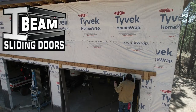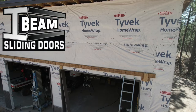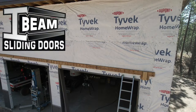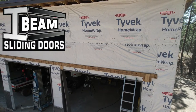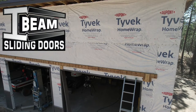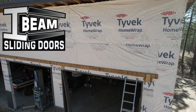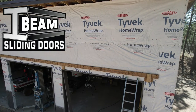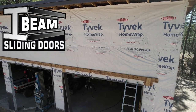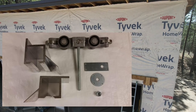What I've done is put up an inch-and-three-quarter LVL that you see right here. I pre-drilled it and recessed the holes for hex lags — these are five-and-a-half-inch hex lags. This is an inch-and-three-quarter by six LVL, with 60 feet on the outside and 60 feet on the inside. That'll allow me to mount this face-mount track system onto it.